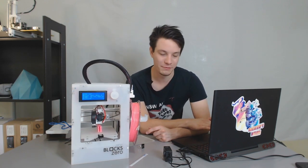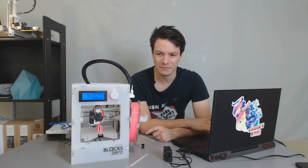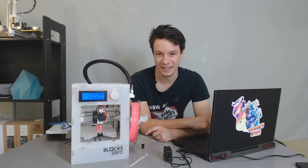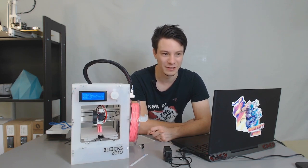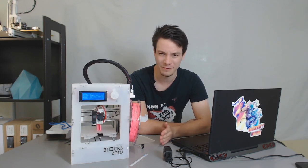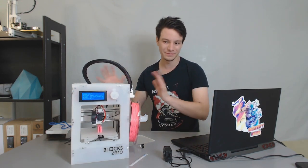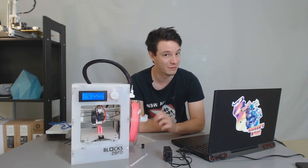Deema's asking, do I know any 3D printers with a welded steel frame? I do. Welding steel is difficult because you get warping to a degree. The machine I know that has welding is like the Mancati. I don't remember what it's called anymore. The original Mancati, and that was a terrible machine. It was like an Ultimaker clone. It was heavy, but it wasn't very good. I don't think the CraftBot's welded. I think it's all screws. I wouldn't recommend welding, honestly, on a chassis. I'd recommend folded sheet metal and screws because then you can align things and tension up. Welding is like 3D printing. It warps. As it cools, it shrinks. And you end up with dimensional inaccuracies, unless you do it really well and you calculate for those.